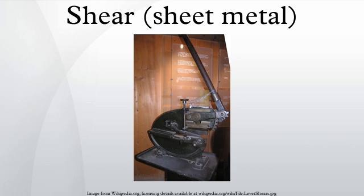The design of press tools is an engineering compromise. A sharp edge, strength and durability are ideal, however a sharp edge is not very strong or durable, so blades for metal work tend to be square-edged rather than knife-edged. Typical workpiece materials include aluminum, brass, bronze, and mild steel because of their outstanding shearability ratings. However, stainless steel is not used as much due to its tendency to work harden.